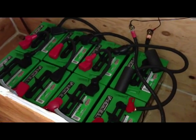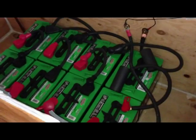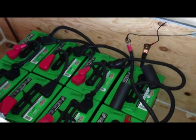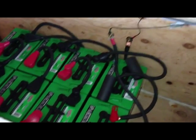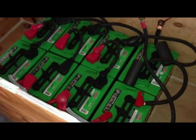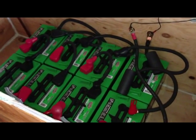I added another couple of 6 volt deep cycles. Now I've got about 900 and plus amp hours — 232, that's 700, that's about 932 amp hours, maybe a little bit more. I just calculated it in watts a moment ago: it's 11,136 watts is what we've got now in terms of total capacity for running off-grid or backup if the grid went down.